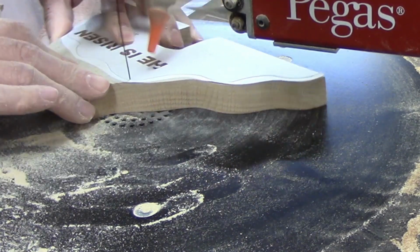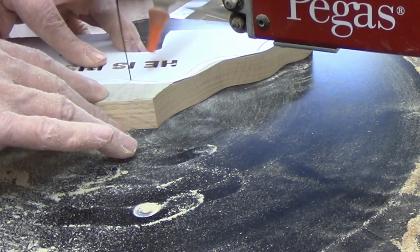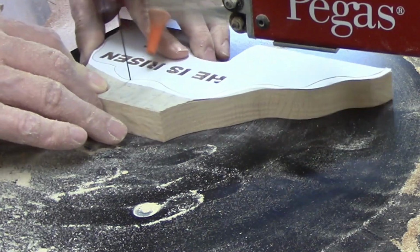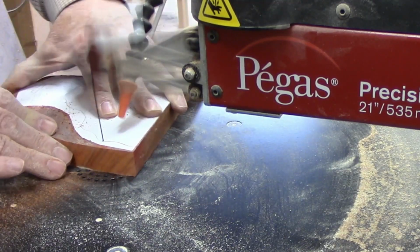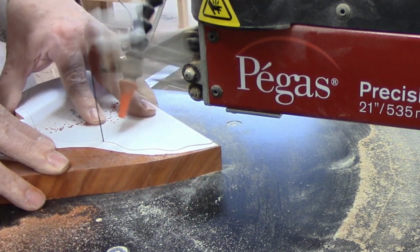The oak piece is now complete, so I pulled off the pattern. One of the reasons I like using scroll saw tape is that patterns usually pull off in one piece, leaving no residue behind. The Padauk heel is just one long outside cut, but there are several 90-degree turns for the crosses.